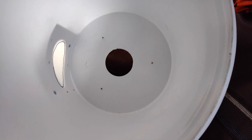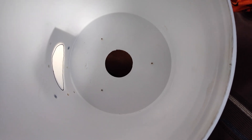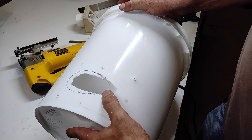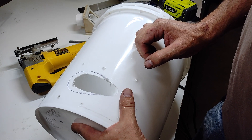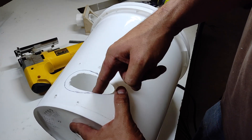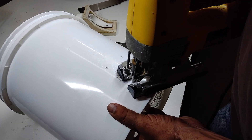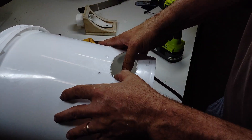Here you can see the rough size of the opening that needs to be cut out. I took a sharpie and traced out that highlighted area. I put the inlet back on and was able to trace from the inside through the hole a bit more accurately. I cut out and filed the part I couldn't trace — where it got a little too close — using a utility knife, filing it to where it needs to be. Let's cut this out and clean it up with a file.